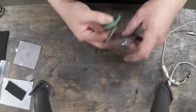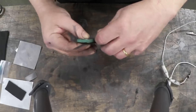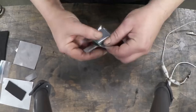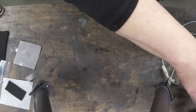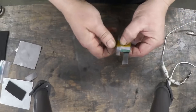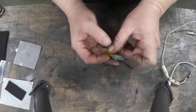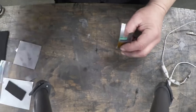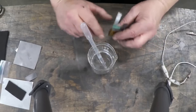That's your completed battery. Now we pop it in a plastic bag — I've got a little plastic bag here, and I'll cut off the top so the ziplock seal doesn't get in the way. Give the whole thing a squish down and hold it together with a bit of sellotape. Like that, that battery will last forever — it's just not going to do anything. What we need to make it do something is add an electrolyte. The electrolyte is 20 millilitres of vinegar and one teaspoon of table salt. That's the magic electrolyte.